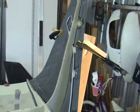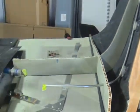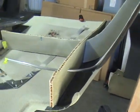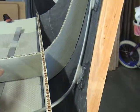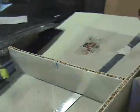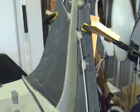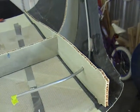I decided that it's going to be too difficult to check the clearance with these things in there, so trying to put the top of the wing lid on there isn't going to work very well. I've also decided to go ahead and move this spar back the ten and a half inches. I saw that it really isn't going to interfere with the probe, which I thought it was before because I imagined it going all the way to the back. So I grooved out the bottom where I'm going to put the micro epoxy fillet in there and I'm going to stick them down and then fit the top.